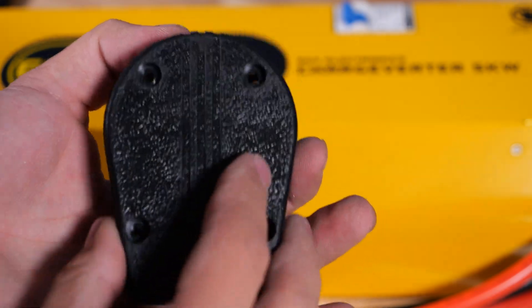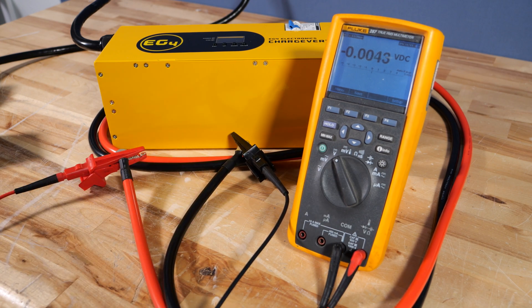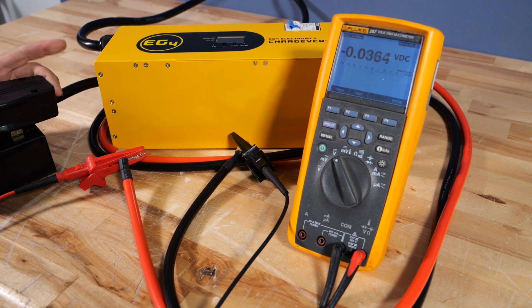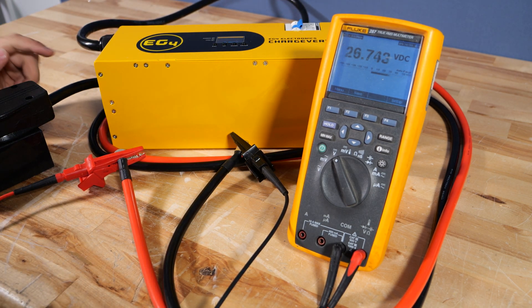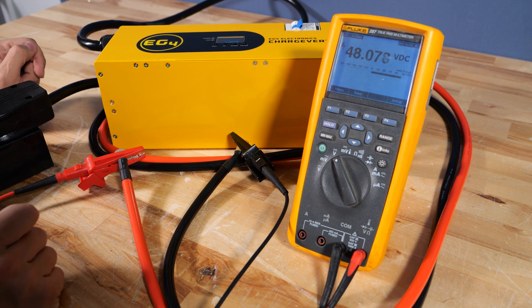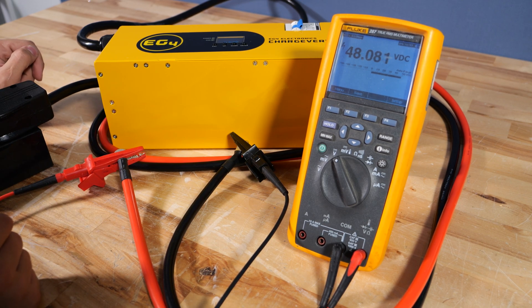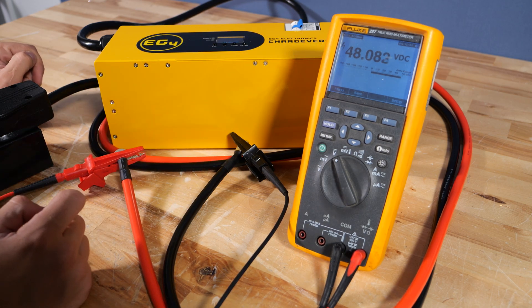Now that our plug's wired up, we're ready to get this thing powered on. Before I get this connected to a battery, I want to demonstrate one of the best features about this Chargeverter — and that is it can reactivate a fully depleted lithium battery. For example, if your BMS is shut off, if I plug in power and flip on the breaker, the Chargeverter will boot up. We do get some fan noise — the fans are actually a little loud — but you can see we have 48 volts output, which is the default setting. The fans are going to ramp down because this is under very little load, but if you had a battery and needed to get it activated, this could definitely do the trick.